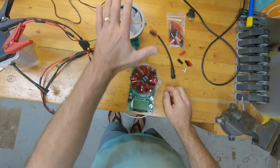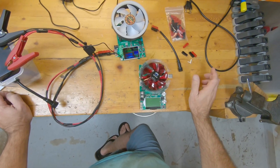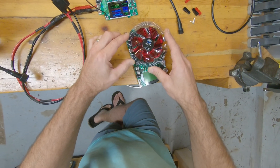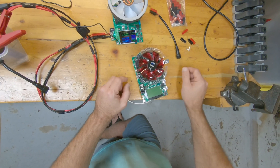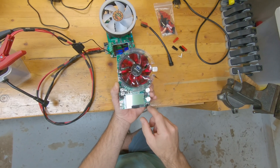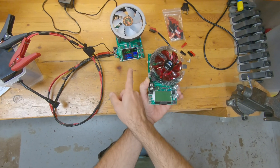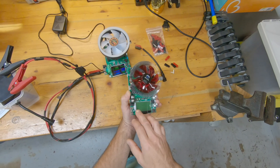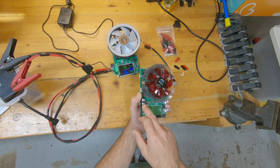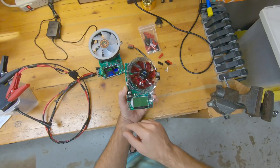The other one over here is 185 watts, but I'm not going to be doing things up in the 20-amp discharge range — I just don't need that. The heatsink on this unit is very lightweight, you can see the fins there, they'll bend fairly easily. This unit is $50. Very difficult to adjust for the low voltage cutoff. It also does not have a time delay like the other one has, and it does not have a four-wire sensing or load-line capability, which is a little more accurate.